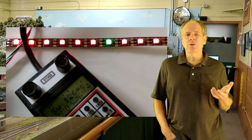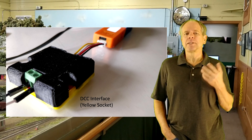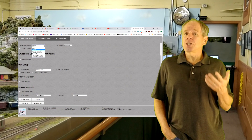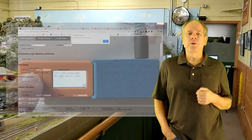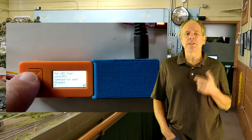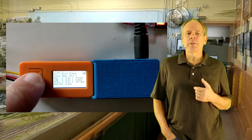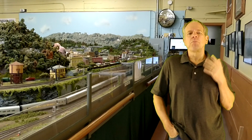For longer LED chains, the blue box features a 3-amp DC-DC converter which then also powers the IOT Stick itself. If you want to use DCC instead of LocoNet, all you have to do is replace the LocoNet port with a DCC port, change the command source in the configuration screen, and off you go. Of course you can also leave both port modules aside and just use the built-in Wi-Fi to connect to your MQTT server, and there are many more possibilities.